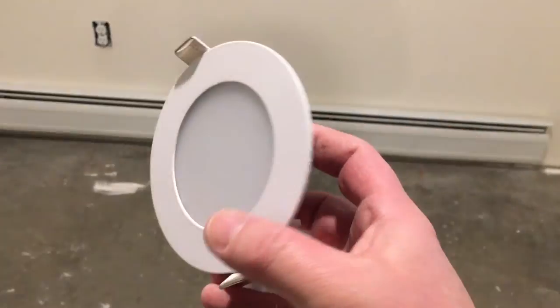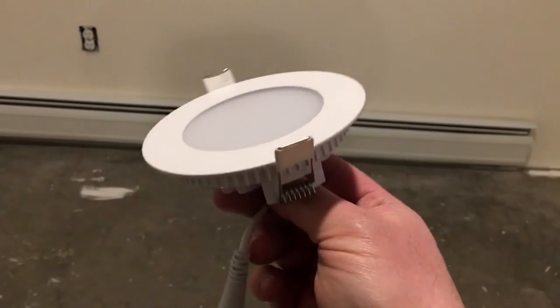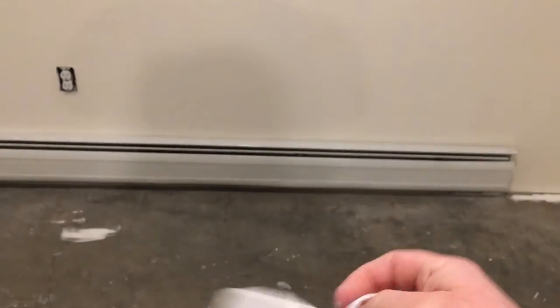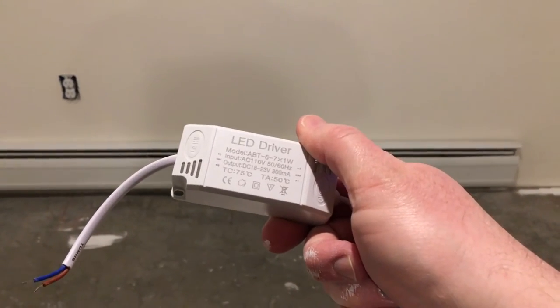So one of the next projects I'm working on in this build-out right here, this is where our water pipes are. We're going to put these recessed lights in. Check this out. So we have some low-profile recessed lights right here. Really cool. These are 24-volt low-voltage LED lights, and they come with a transformer. You can wire them up to 120-volt. I did go ahead and rough in the lights here. I went ahead and snapped a chalk line, and the four lights are going to be drilled in.